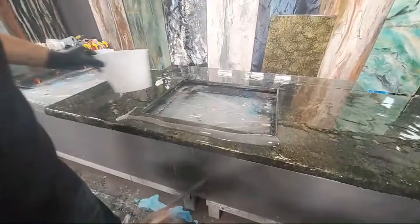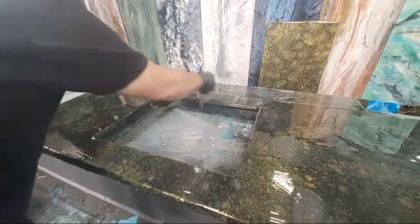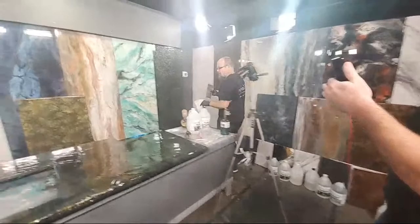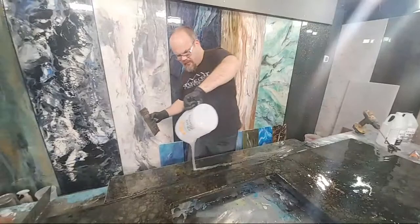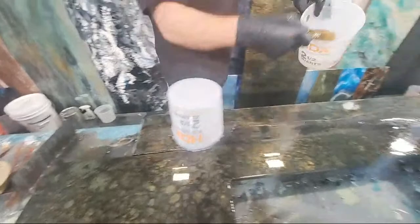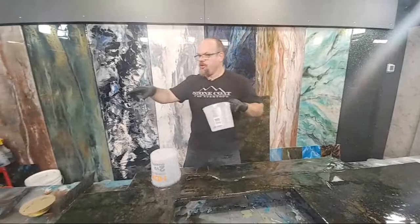Let's go ahead and do the bars here. I'm just going to add a little bit of material, then take my trowel and go back and forth, and that bar is done. Same thing on the back — pour it right in the middle, go back and forth. Boom, that's done. Now let me go do that windowsill. So I'm just going to pour this on the windowsill. I've already got some residual right here that would have been wasted, and it's just come onto the sill — that's why I like to butt them. A pro tip: I like to finish with the smallest pieces first.